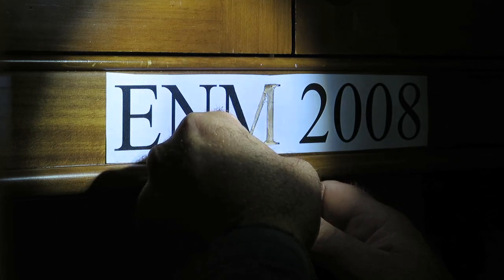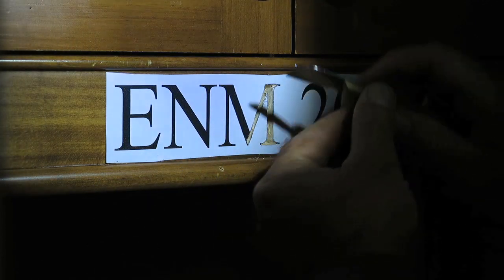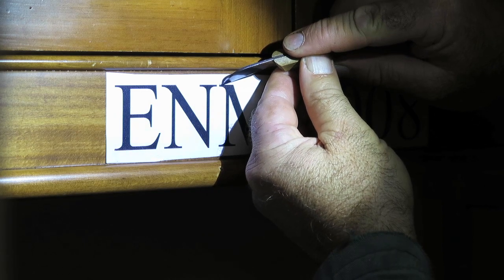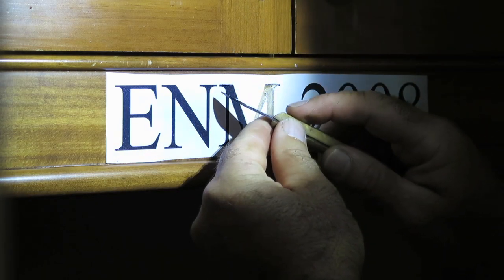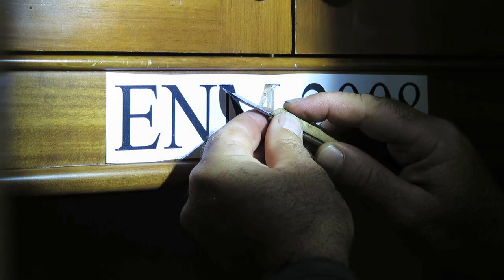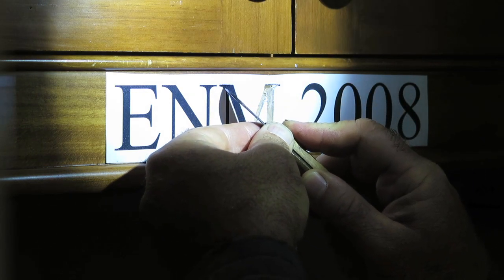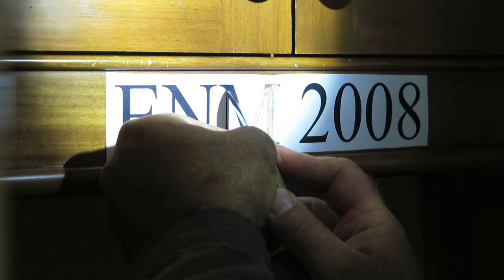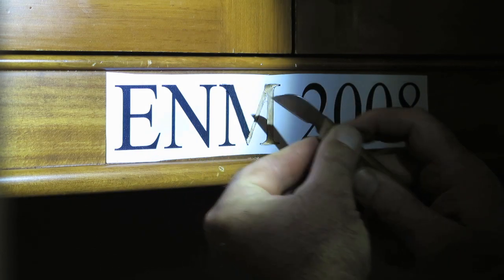You want the two cuts that form each side of a portion of the letter to meet at some distance down in the bottom of the wood. That distance is roughly the same as the width of the section of letter you're working on. So wider sections will have a deeper cut than narrower sections, such as that upright portion of the letter N just to the left of where I'm working — that will be shallower because it's a narrower part of the letter. Just outline with the knife tip at the correct angle.